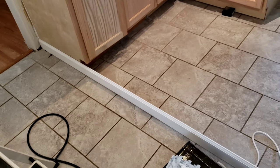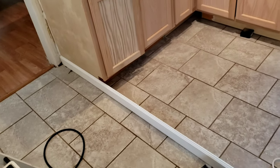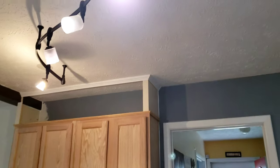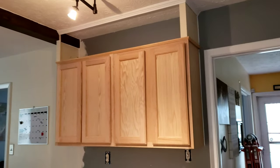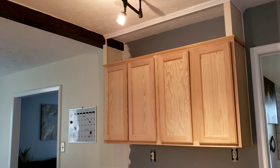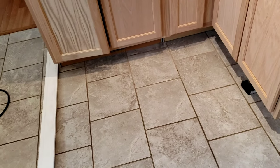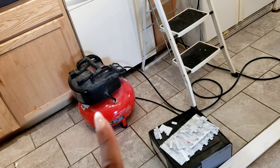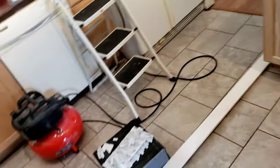I'm about to go out with my miter saw and start cutting these. Cutting baseboard is a whole lot easier than cutting crown molding — crown molding can be very difficult. I'll leave a link to that video because I don't feel like I could properly teach it; I kind of just figured it out on my own. Once I'm done placing the baseboards I'll be using my nail gun and air compressor with two-inch nails to install it.